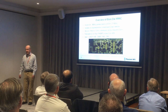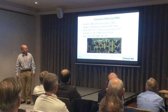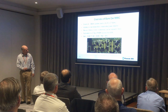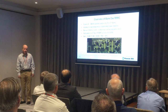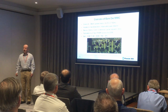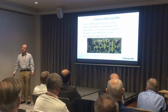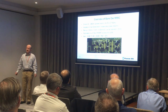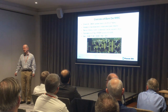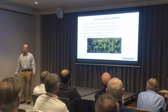This is the Verdun — that's a nice crisp clean photograph at the bottom. It has two output devices. You'll always see with microwave millimeter wave PAs a number of output devices power combined, and that's because you can't just make one huge device — the parasitics of the transistor increase as the unit width and number of fingers increase, so the gain starts to drop off. It's a trade-off between gain and output power.